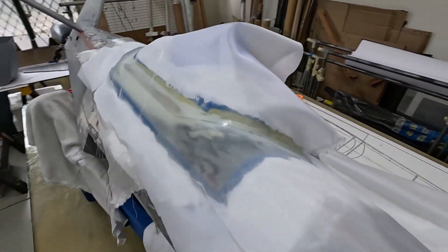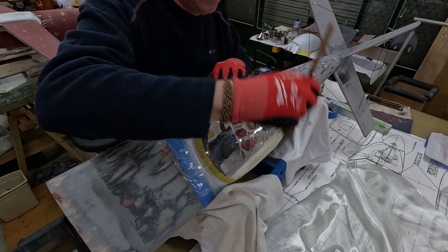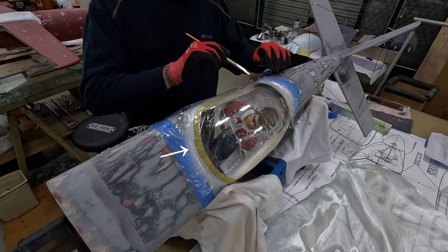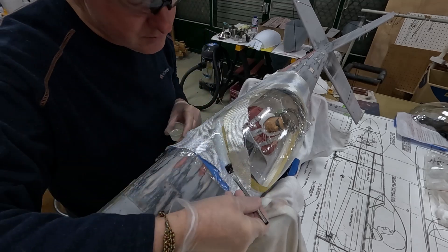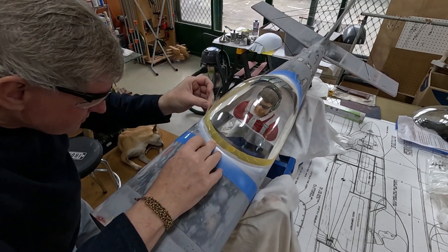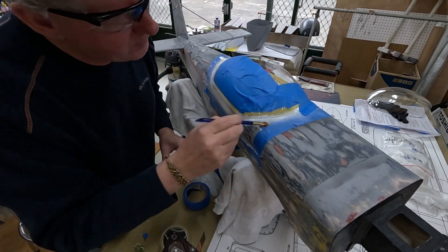The first side of the fiberglass framework is down - two layers of six-ounce cloth and one layer of two-ounce cloth. Originally I had wanted to use food plastic cling wrap as a barrier. I didn't want to use clear packing tape because it does not take compound curves well and would wrinkle up in the seam between the canopy and the fuselage. That clear plastic cling wrap just did not work - it wouldn't stay down and it pushed up the fiberglass. So I abandoned that pretty quickly and reverted to the packing tape, using multiple small pieces to manage the compound curves. I did have to cut the tape at the seam between the canopy and the fuselage, which drove me to consider using Vaseline.